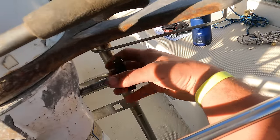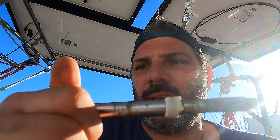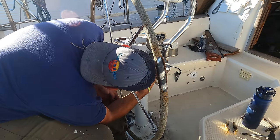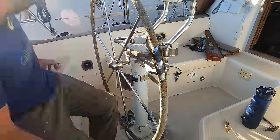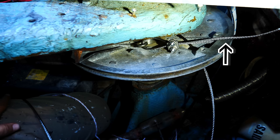Trying to get this piece threaded out — it's kind of sticky. A lot of the problem is that the bushing is just cracked, which is probably why it was so sticky previously. One of our friends here, Dave, has extra chain for the steering. The cables are brand new, so might as well replace the chain too — he's heard of a couple inches of chain failing. CalicoSky's steering system is largely original, making it almost 40 years old. Parts more commonly prone to failure are being replaced, including the brake, steering chain, cables, and cable clamps.